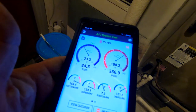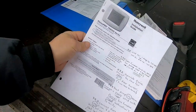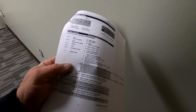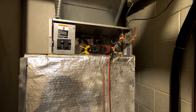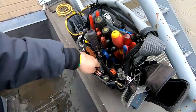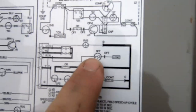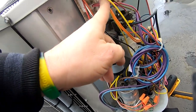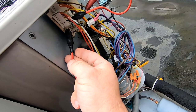Our pressures are right up there where they should be, so everything's looking pretty good. I shut the unit off and grabbed my booklet to double-check the wiring. Everything looks like it's set correctly. Based on pictures from the people working here, this thing had about four inches of ice on the outdoor coil. We're going to put it into defrost to make sure that's working. The defrost termination switch is a normally open switch — I'm going to short those pins together with a jumper to initiate defrost.